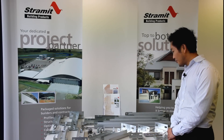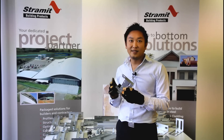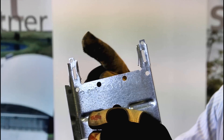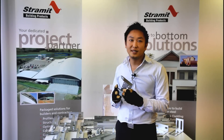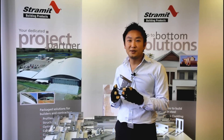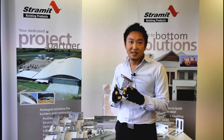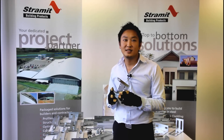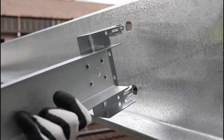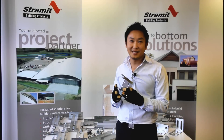Let's have a look at some of the components that make up the bridging system. This is the locator and it's easy to recognize because of its two prongs. This is the first part of the bridging that touches the purlin when you're installing. They come in range sizes to suit 100mm, 150mm, 200mm and 250mm purlins. This locator and all the parts shown here today are for the 200mm purlins. The prongs on the locator are set up at the right position to work with the holes punched in your purlin, including the 16mm spacing in Victoria.